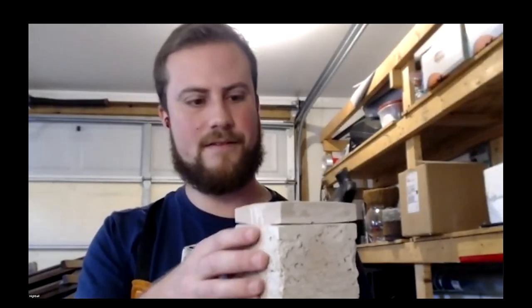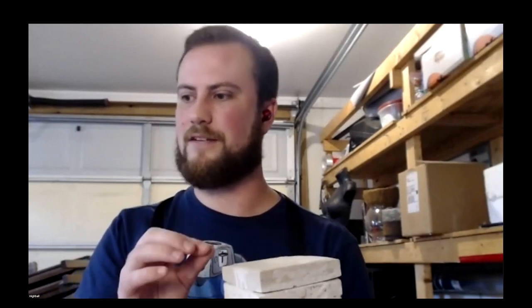Correct. So the debind, and I was touching a little bit on the ramp rates. Assuming that you've properly benchmarked your microwave, my process is to calculate where I want my set points for my debinds, which would generally be about 400 degrees Fahrenheit and hold for X amount of time. I'd ramp pretty slowly and then go up to about 800 degrees and ramp again at whatever rate I deem would be good at the time. That's changing, but that process would take probably a couple hours to make sure you've totally debound the part. From that point, you take it out, and you could either let it rest or start the sinter immediately after. But the part would be out of the microwave, and specifically for aluminum is where things deviate a little bit.